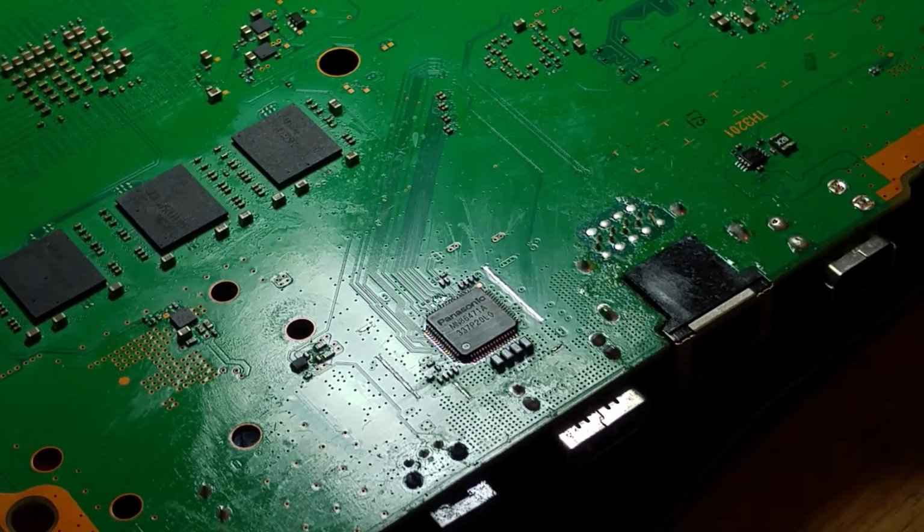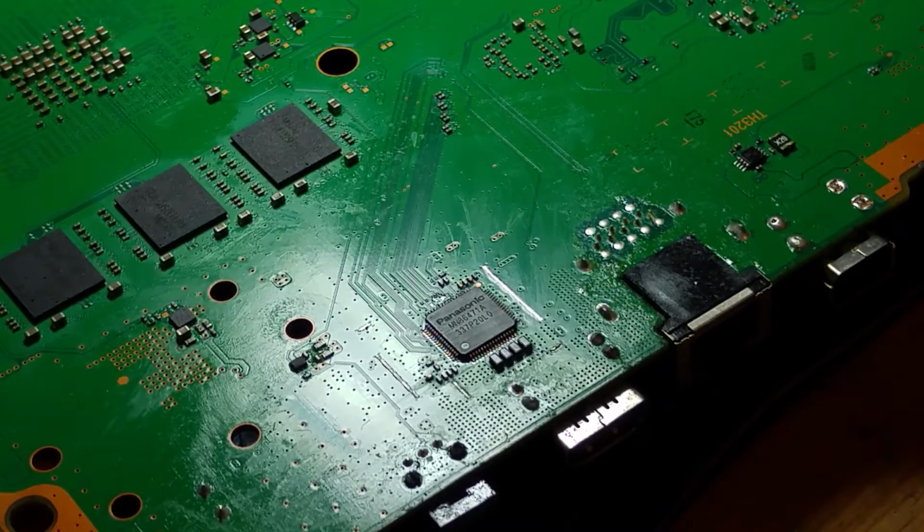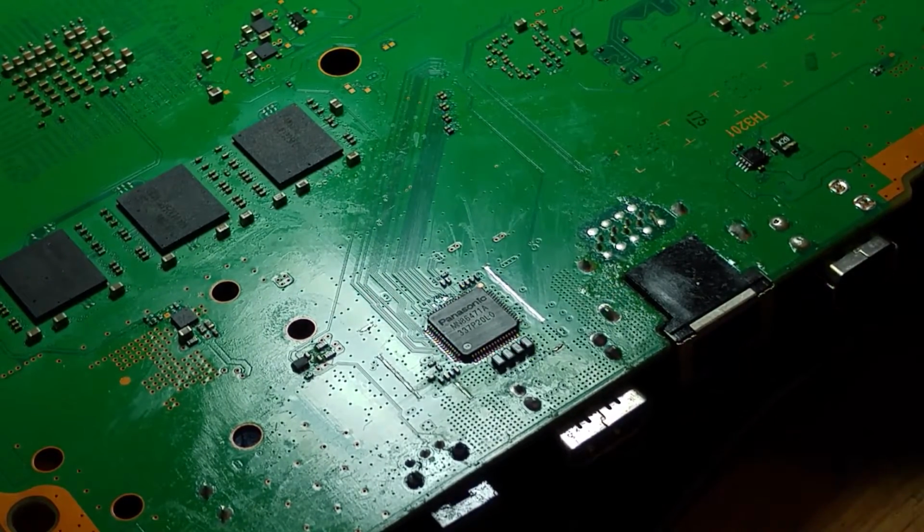And what you can sometimes find is when certain components are faulty, that figure will change. And if you log these down in a spreadsheet or a Word document or something like that, you can quickly build up a decent little portfolio of figures as to what they should read when they're good and when they're bad, and what certain things read when certain other things are bad. So you can start to build up a picture of what part of a circuit might be at fault if, for instance, a certain component is bad. And it's quite useful to give you a start in situations where you're struggling to pick up what's wrong. So that's what I've been doing.